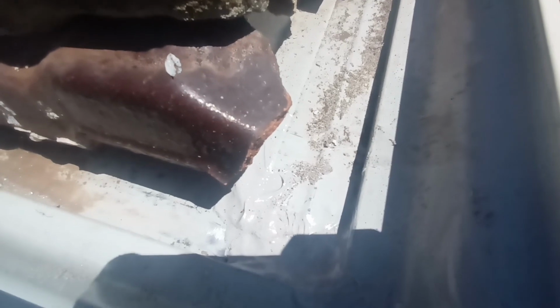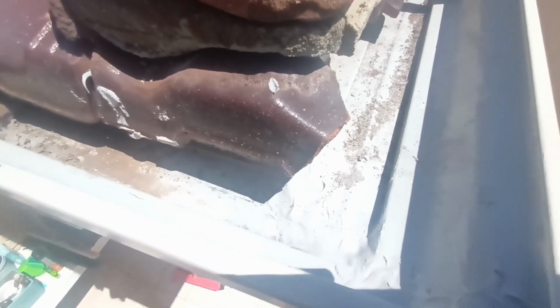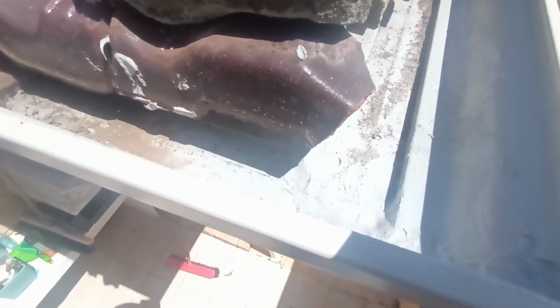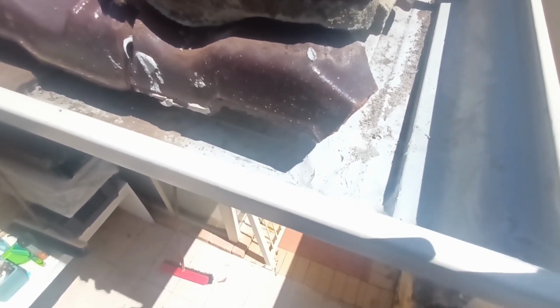You can see it's all sealed up the front, goes right down around to the back. We put in the extra piece of tile, which we could do because we could move this down, put the tile in, no dramas. And that's how you seal a miter. That way you know it's done. Make sure it's all dry. This one wasn't wet, but if it was wet, I would dry it out, either with a heat gun or rags, and then add your silicone.